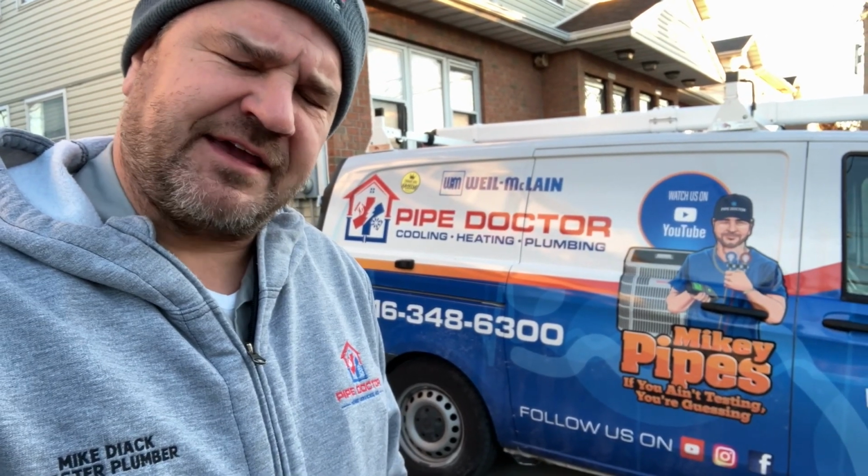It's me, Mikey Pipes, back here at this service call where we had a landlord-tenant issue regarding the heat and who's going to control the heat, and it's too hot and it's too cold. Well, we had solved the problem with installing remote thermostats with wireless temperature sensors, and that's going to allow the landlord who lives in the basement to have control of the first floor and second floor based on what it's actually reading up there. Today, we're going to split the basement zone, which is tied into the first floor system.